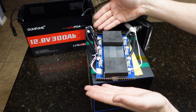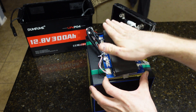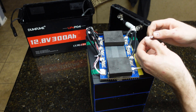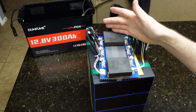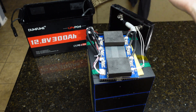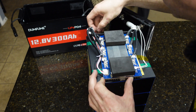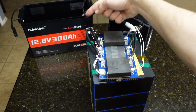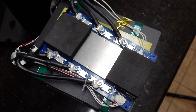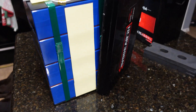As for the BMS, it has a nice beefy unit with a large heatsink on the bottom, though it's not physically secured to the battery — the foam sandwiches it in place inside the case. There's a thermistor marked 75°C, which appears to be only a high-temperature protection. This battery does not appear to have low-temp cutoff protection, and it doesn't advertise it anywhere. The BMS performed well though — we pulled 275 amps through it and it didn't smoke or give up. The balance harness connector has a little goo securing it so it can't come loose.